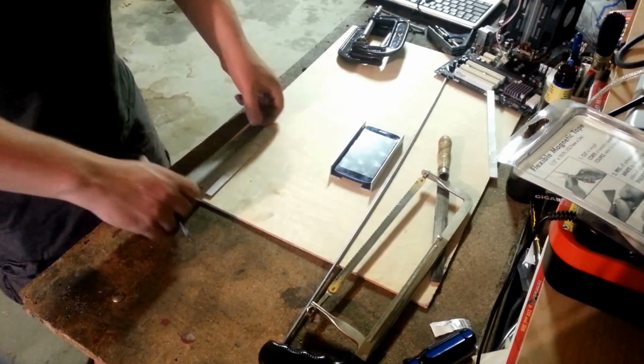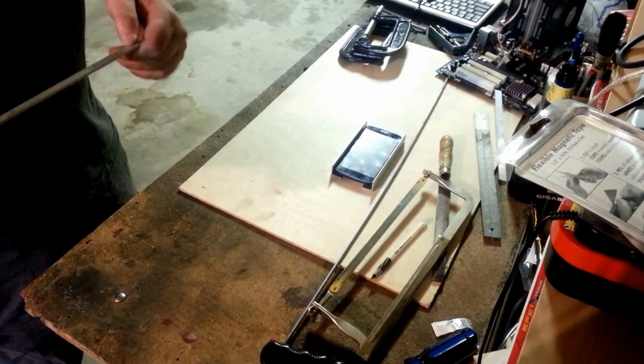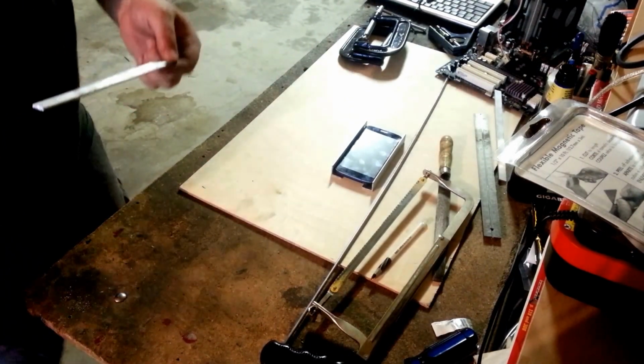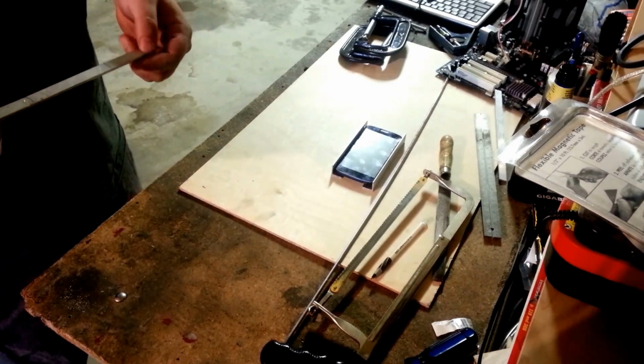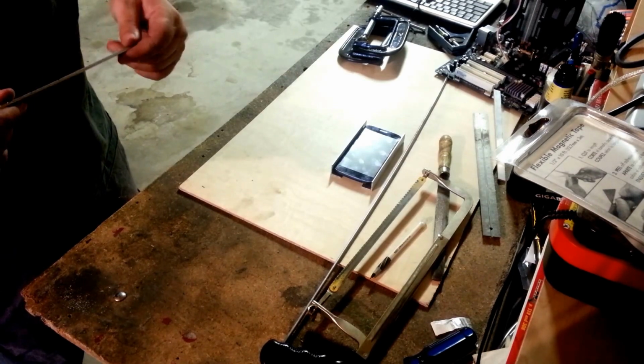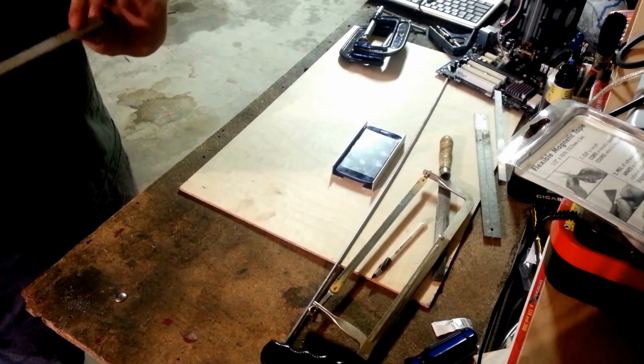And that's where we need to make our bends. Now, aluminum's pretty soft. You can get away with bending it once, generally. Just don't really torque on it or you might break it off. But once you've bent it, you're not going to bend it back, at least not more than maybe once or twice. Otherwise, it'll just crack and break in half on you. So you better get this right the first time.